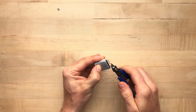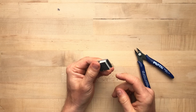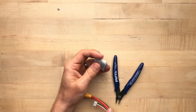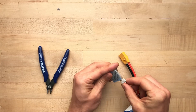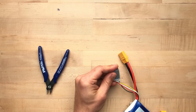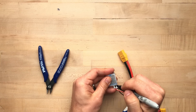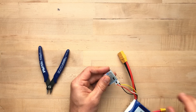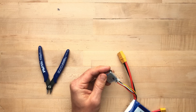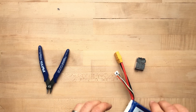With the 2-to-8S version, I love these but I don't use 8S cells, so my little trick is to clip all the leads back to 3S — these things are cheap to begin with and this makes lining them up much easier. You could also take your pack, hook it up correctly, and make a witness mark with a Sharpie so you remember which way it goes in the future.